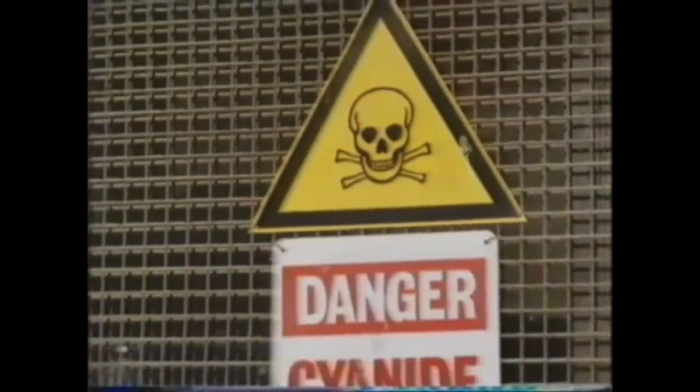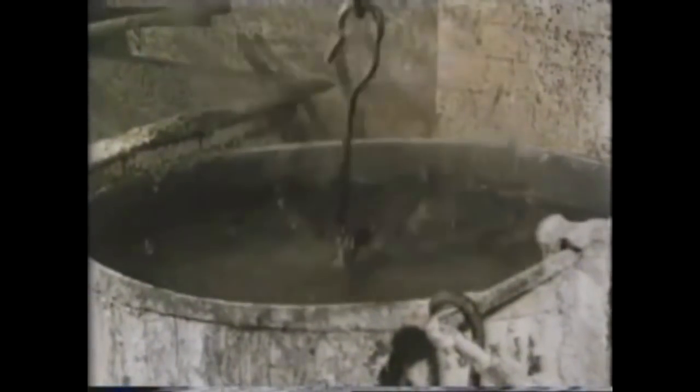It is possible to case harden components without creating such coarse structures. These spindle shafts are made from a low-carbon steel. After preheating, they're carburized by immersing them in a liquid bath of sodium cyanide and sodium carbonate, which also contains a little sodium chloride. They're left in the melt at 900 degrees centigrade for 1 hour. This is time enough to impart a thin carbon case, but not long enough to produce noticeable grain growth. After an hour, they're quenched in water to give the required hardness to the surface and a clean finish to the component.